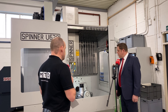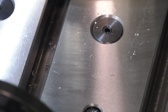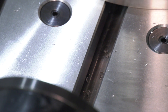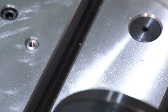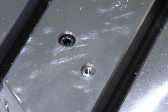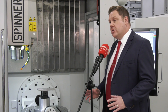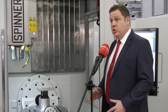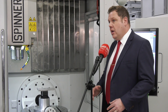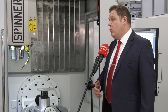I want to touch on this table, because there is an outer ring on here which can be removed. The advantage is to do with interference and tool length. The table gets its name from its 630mm diameter, but when looking at smaller components, we can reduce that diameter to reduce interference and reduce tool length. From a reduced tool length, we get greater rigidity, which pays dividends in terms of accuracy but also surface finish.